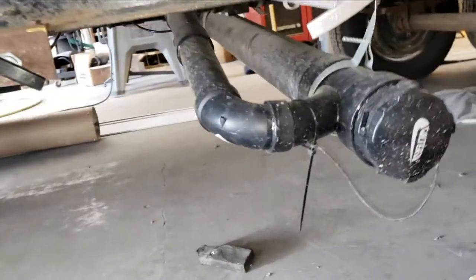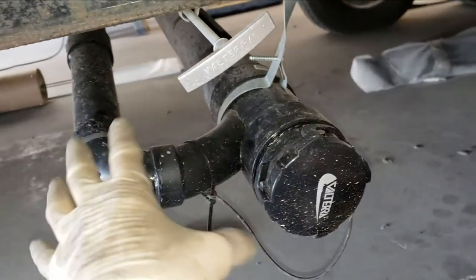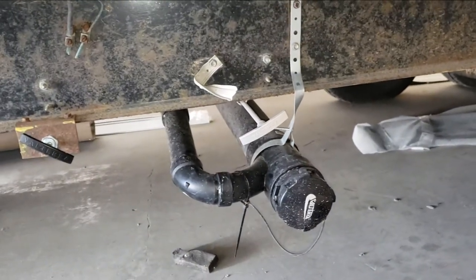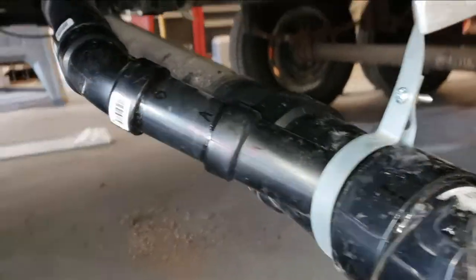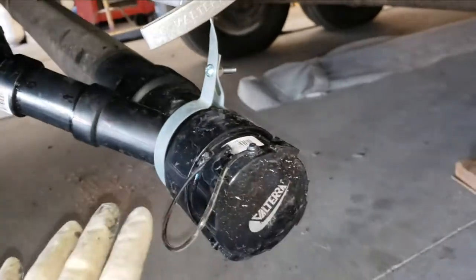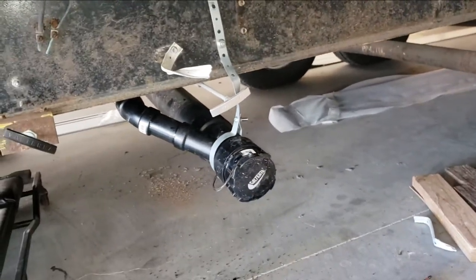It's just standard ABS. I'll cut it back and glue it so the gray tank goes straight in here — so we don't have a place where solids can get plugged. So basically just like that — a little bit better. We have it coming straight down from the gray tank valve, so it's always going down, and the black is sweeping out too. So it shouldn't back up into there. That was easy.